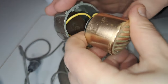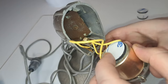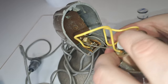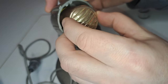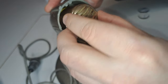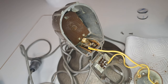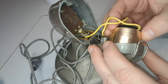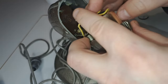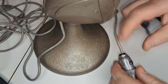All that remains now is to attach new foam pads — it's just a matter of figuring out how many to use. I don't remember if I used three or four in the end, but whatever fits for you. You have to have the capsule in the right direction because the cables need to fit as well. The cables are quite long so you can open and service it, which is good but makes it a little difficult to put back together. It seems I only used two foam pads — I misremembered completely. Anyway, it's just putting everything together and then adjusting the grids so they are aligned.